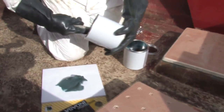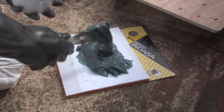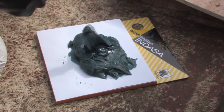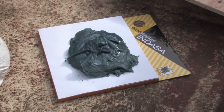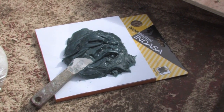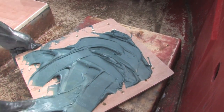For the second piece of wood, we've drilled through a series of randomly placed holes, and the Free Fix will just squidge up through there and give a good firm bond. This time Rowan is using these great little Rhino mixing boards — it's a specially coated paper mixing board that you do your mixing on, great for any small jobs. You just tear away the sheet and throw that away, and then you've got a new mixing surface for your next batch. A great little tool. And once again, we just spread that out nice and evenly.